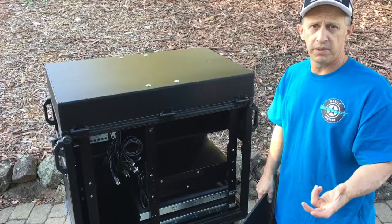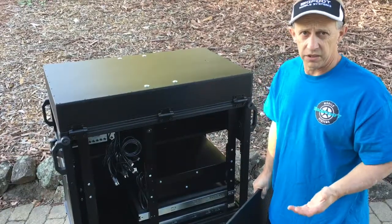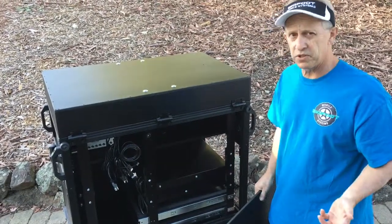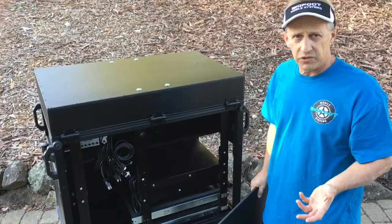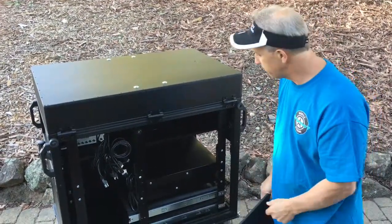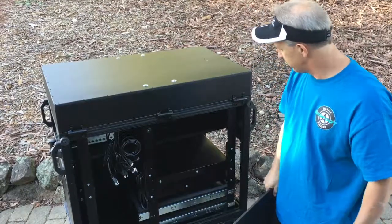Road cases have foam in there. They have shock racks that have foam squeezed with wood. There's no clearances, and much equipment needs ventilation, especially out the sides. So this allows us to not only do installations much more efficiently and give you access for any type of maintenance that you might want to do, but you could even pull the panel off and get ventilation on a very hot day and open the cabinet completely up. You can have an optional side on the opposite side as well come off. That's just an option that you can ask for.